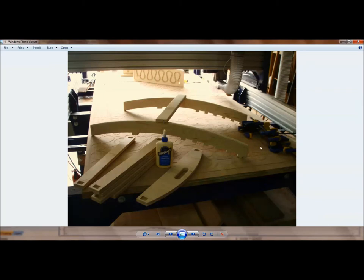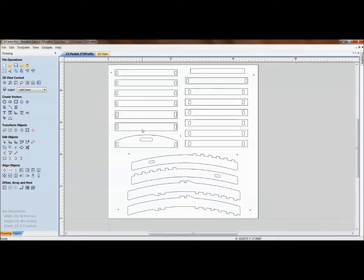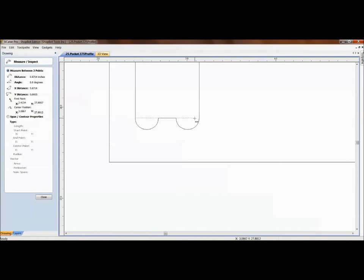Referring back to that patio chair — you can see the mortises and tenons in the cut parts. When assembling, we put glue down inside the pocket and then push the parts together with a clamp. Looking at this file, the joinery uses mortise and tenon. This actual file was drawn for material that's 0.71 inches thick. Materials can range anywhere from 0.69 to 0.74, even within the same bundle. A project like this would need slot modifications — if the slot is 0.72 wide and the material is 0.74, it won't fit.